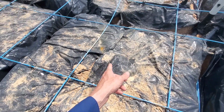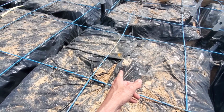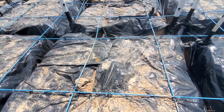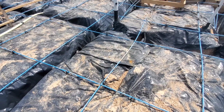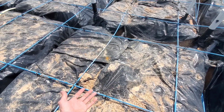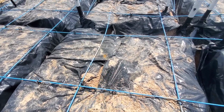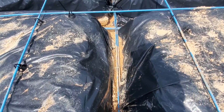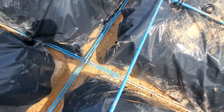Now I saw this on a remodel job just about 2 weeks ago, where the guy had moisture coming into his wood floors, big black stains on the brand new wood floor. That remodel was about a year old, and I tested, and of course it's moisture. He showed me pictures, and they did not replace the vapor barrier there, so this has to be fixed.